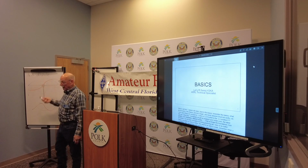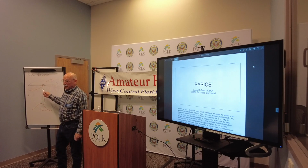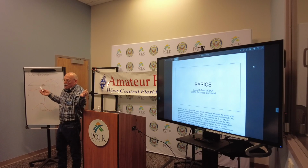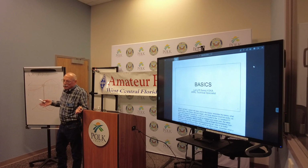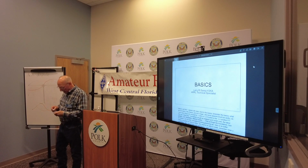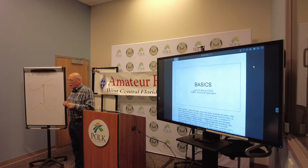My dad running his SB-101 fed it with 75 ohm cable. It reduced the mismatch here, and the old radios didn't care. You had tuned output, so you loaded it anyway, so he didn't care. It worked fine at 75 or 50 ohms.